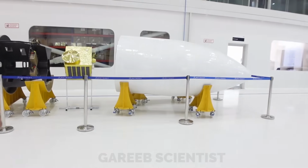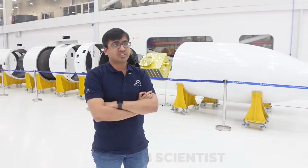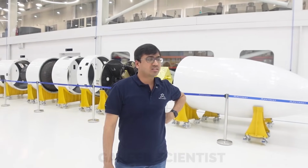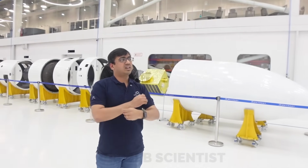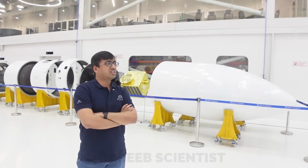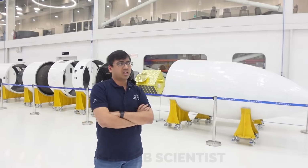Okay. So fairing, simple to design? Fairing is, again, here also the tooling is complicated. So you should build the tool, big steel tool. I think maybe in some of the pictures it might be there. There's quite a big, steel, shining tooling which we need to make. That takes a good amount of time. After that, I think it's fine. It's all layup, and then you build the carbon composite shell, and then it's anyway light enough.